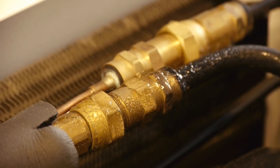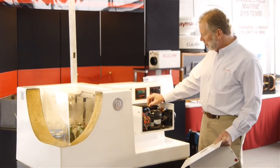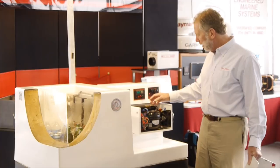Quick connect fittings connect the copper lines from the refrigerator section to the compressor section. These are metal-to-metal seals, so when you disconnect them they'll reseal. Servicing a compressor or sending it back for refit or repair can be easily done by the boat owner.